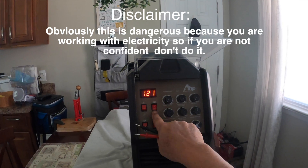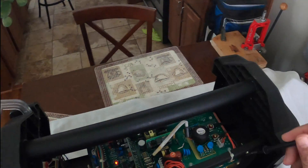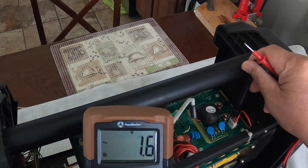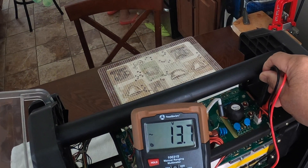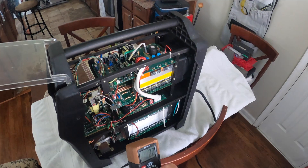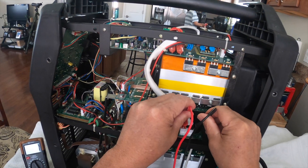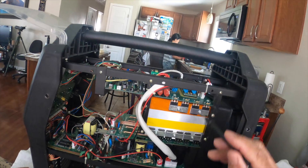I'm going to put this on 2T stick and DC and I need to find connector X9, which is this one on the top, and put my meter on 200 volt AC. I'm only reading 13 volts and it's supposed to be 150 volts. The next test point is supposed to be 300 volts DC.